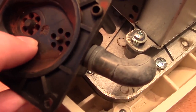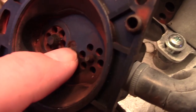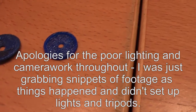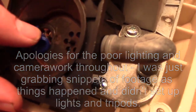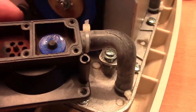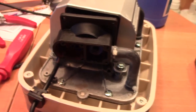Here's the problem: I'd measured the diameter of this black ring here and that was 19mm, but there's a moulding mark where it came out of the mould and that was getting in the way. So version 2 of these discs — version 1 was 19mm, version 2 I've made it 17mm. I've also put a little 1mm high lip around the outer edge to try and help it press flat and keep shape. I've put these new valves in the opposite way around so the little lip seats down on the valve seat — they seem to sit really quite nicely, which should increase efficiency and the pressure this thing can do.